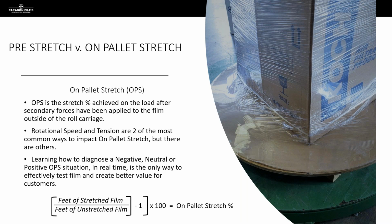So this on-pallet stretch is something we do have direct control over, utilizing that control panel while we're performing a test. And so we need to learn how to not only calculate our on-pallet stretch while we're there with our customers, but how to diagnose whether or not we're achieving a negative, neutral, or positive on-pallet stretch. So an example of negative would be working on a 200% geared piece of equipment and only achieving 175 on pallet. If I'm getting 200% on-pallet stretch on a 200% pre-stretch machine, then I'm in a neutral situation. And where I really want to be is when I'm working on that same 200% pre-stretch piece of equipment and I'm achieving 240 or 250% stretch on pallet, and I am in a positive on-pallet stretch situation.